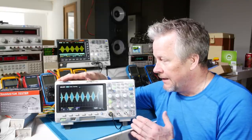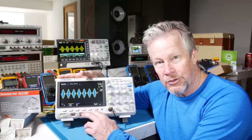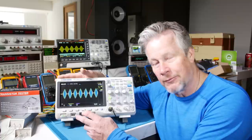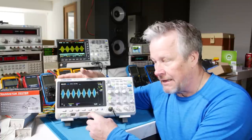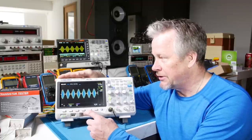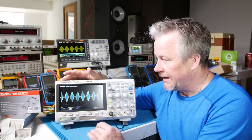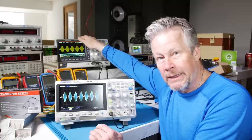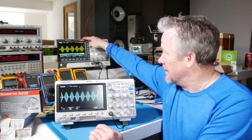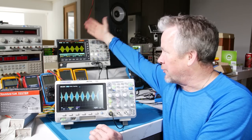After you decide on those things, if you're a digital guy and you're going to do a lot of digital signal work, make sure you have that upgrade option — buy it when you get the scope or make sure it's upgradable. With the X Plus version I could get 16 channels for MSO mixed signal. If you want an MDO mixed-domain scope with a spectrum analyzer, the GW Instek MDO series — no one can touch it; that's why I bought one.